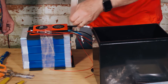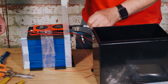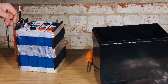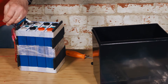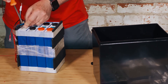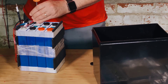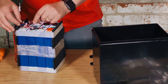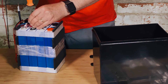We got the BMS and had to cut a small groove in the top of the ply end to make space for the BMS wires, then laid the pack on its side and taped the BMS on. We're pretty pleased with these Daly BMSs — some people dislike them but on the whole they work pretty well for us. We terminated all of the balance leads with ferrule lugs — the ones with heat shrink on them. We also cut the balance leads a bit shorter just to keep things neat. Some people say balance leads should all be the same length, but because they're not under load there's no real voltage drop.